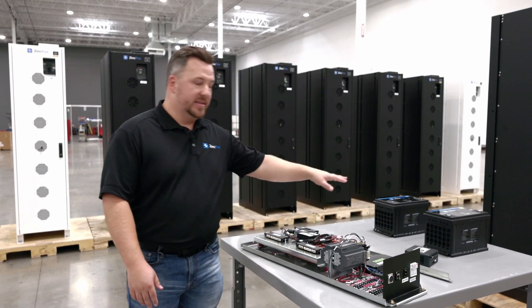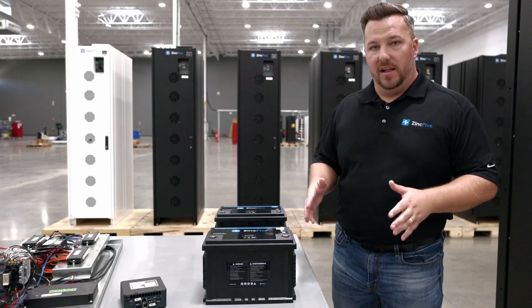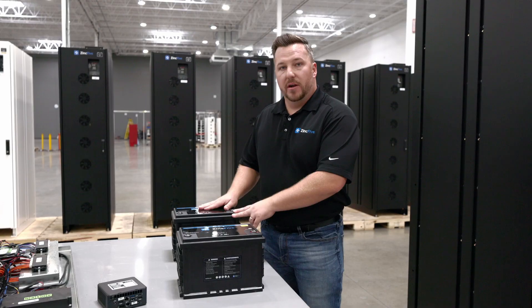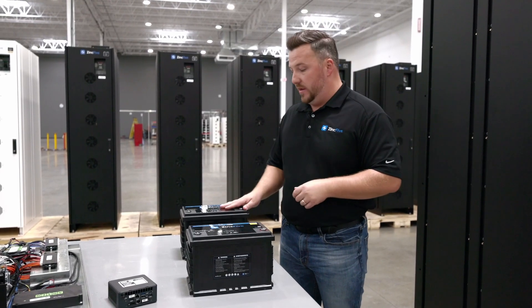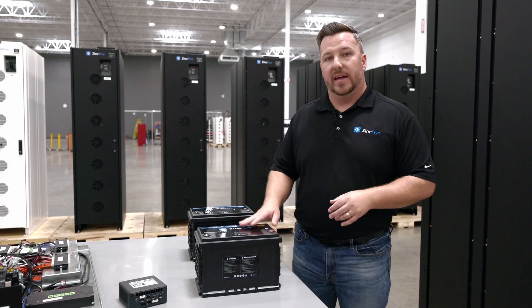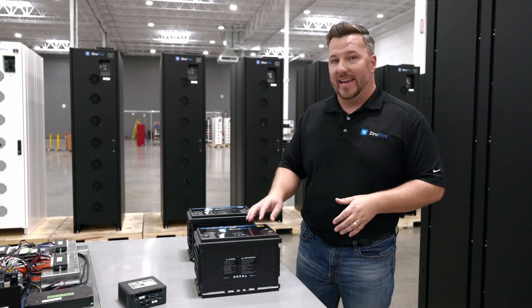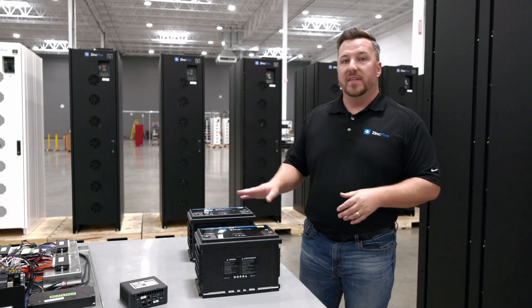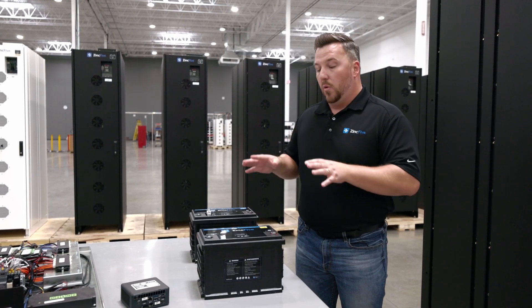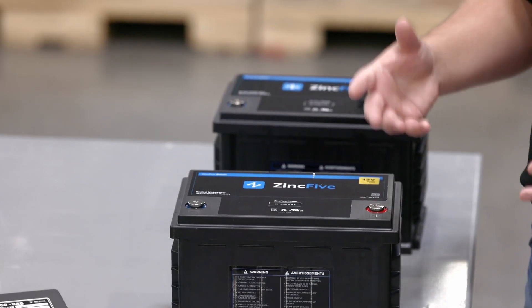Now let's talk about our batteries. We make two batteries — both are 13 volt nominal, 8-cell, nickel-zinc based batteries. We have our blue top battery, which is an 80 amp hour solution, and it comes in our BC2 cabinet targeting around 800 amps of continuous current. For the higher power solution we utilize a 90 amp hour battery. It has the same case and dimensions, but with more active material, giving it higher amp hours, more energy, more run time, and a 1200 amp continuous current rating. Both solutions offer extreme power density and provide sustainability and recycling benefits — we're proud that customers are choosing these batteries to reduce their ESG metrics and provide a sustainable option.